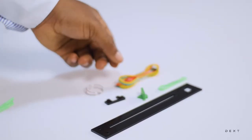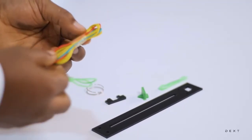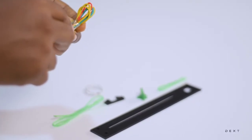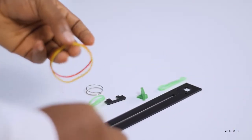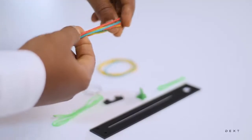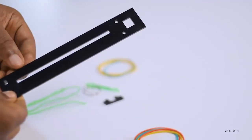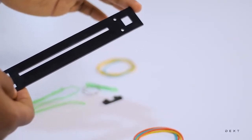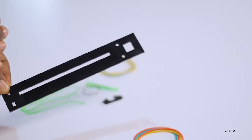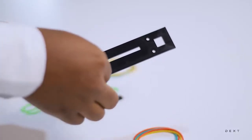The first thing that we are going to do is to make sure that the part of our elastic balance that will provide the resistance needed to measure the weight is in place — and that is going to be our rubber bands. We are going to need 4 bands in order to build enough resistance. You need to note that the body for our elastic balance has this line here, and this line is not perfectly in the center. This side is slightly bigger than this side, and this side is where our dial is going to be pointing.